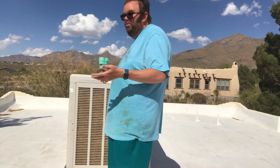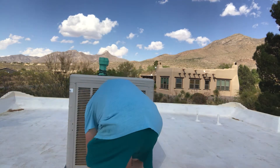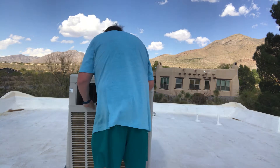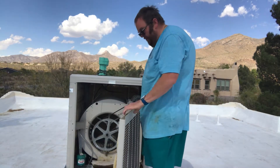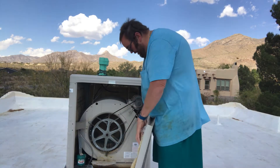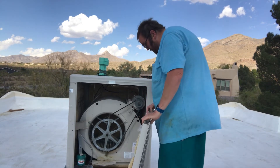And it hasn't been working that great. The air is working — I mean, it blows air into the house — but it doesn't feel as cool as it should. So let's open this thing up. As you can see, there's water pouring down there. It pours into this channel here, and from this channel it goes into the pad. The pad seems plenty wet, but it's not doing the trick.